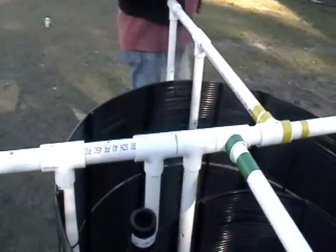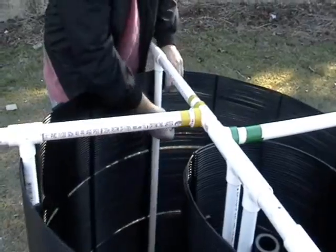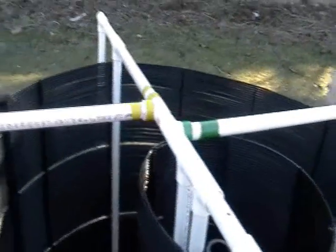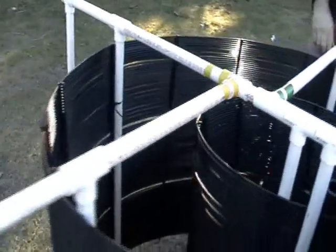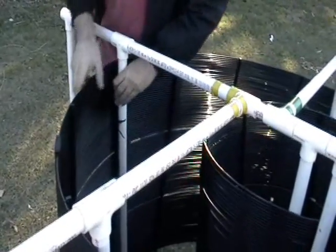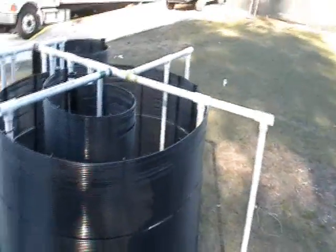We keep going around like so. There are three holes in each vertical bar. He skips one over here — it's unnecessary — because we strap it on the other side, and since it's still taking a tight turn, it stays very stable. So you're just going right to the next spacer bar. There are three holes, so you would actually do all three to give the most security. To be clear, the zip ties are nice for keeping everything off the ground and protecting the panel while we're getting it into the water, but they're not relied upon for the structure once it's underwater. The rack will keep the Hyperloop in position even without the zip ties — that's where these ends grab the headers and make sure that everything stays in place.